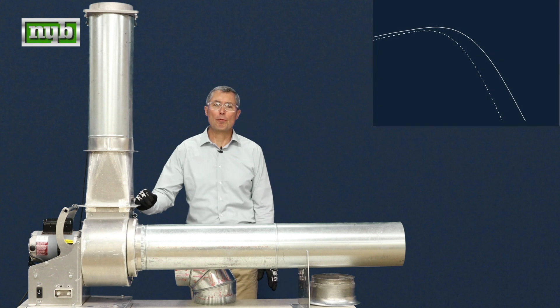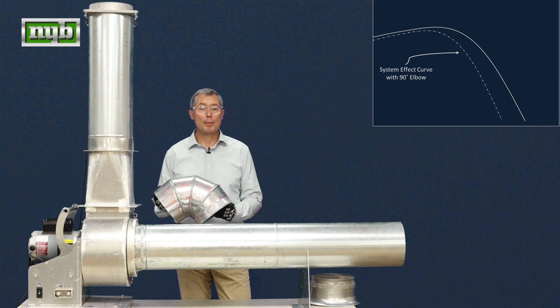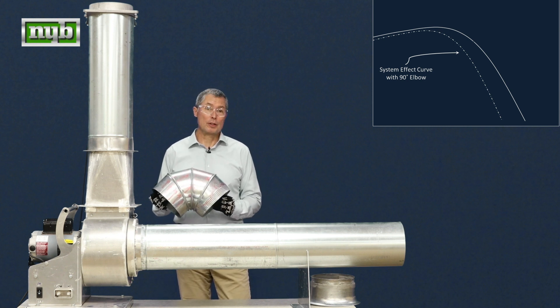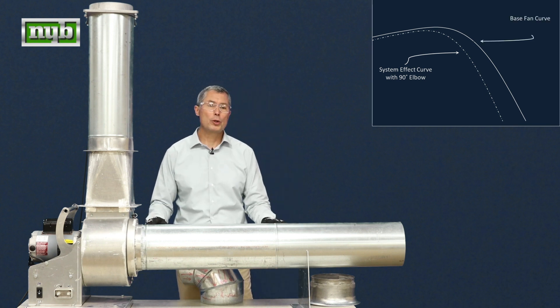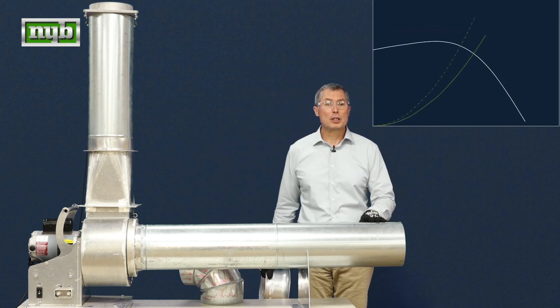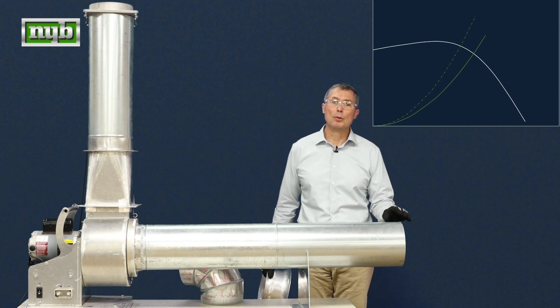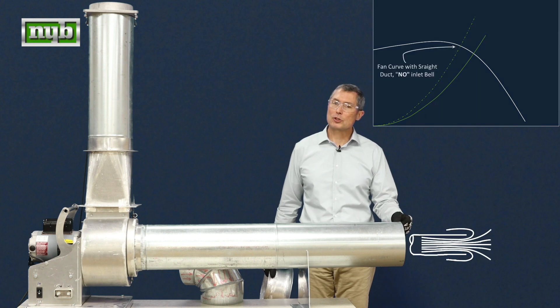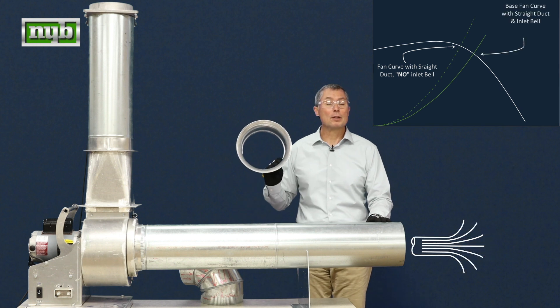All the videos we've produced so far have focused on how systems affect or change the way a fan performs. A 90-degree elbow causes uneven loading of the fan wheel. However, in this presentation we have straight runner ductwork that allows for even loading of the fan wheel — top, bottom, side to side — so the fan is actually performing as catalogued. However, we do have system losses, and those system losses are associated with either good or poor system design. The sharp-edged orifice is causing a lot of losses associated with moving air over it; putting a bell mouth on it eliminates those losses.